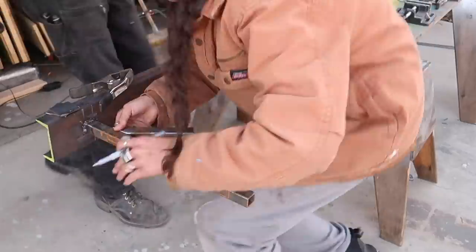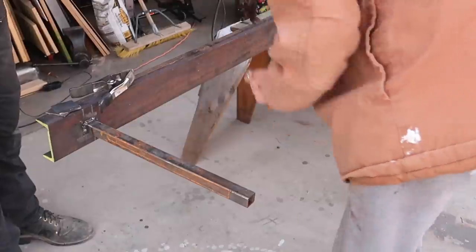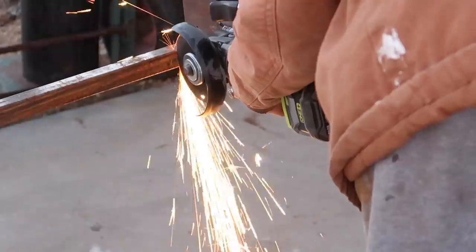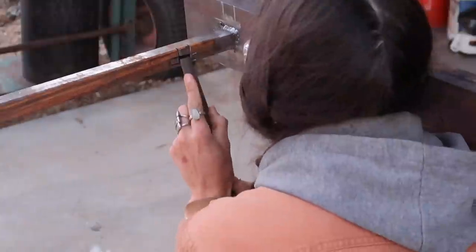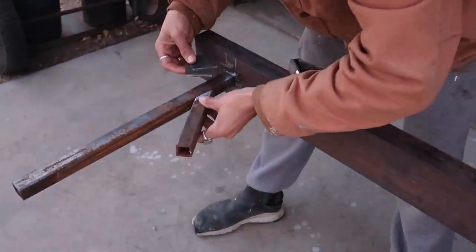The angled piece that I'm attaching to the bottom is where the actual light bulb is going to attach to. So that's why I created a hole and filed it down, because we will be running electrical from the light bulb through the square tube that will then run through that square tube into the back of the spine, down, and then we can kind of connect it to the back end electrical within the wall. So that way it's on a switch.